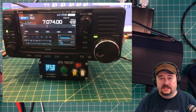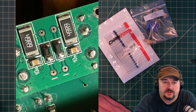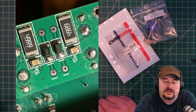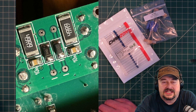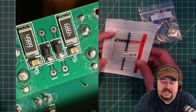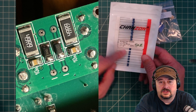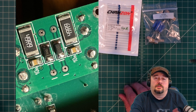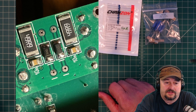This is the bottom of the board and some of the diode configuration. What you should be able to see on the screen now is the underside of the PCB inside the antenna tuner. This is underneath the SWR bridge or the coupler. The two diodes are in the middle, and one of them you can see is an SA-13. The other one, the markings are really faded on that, but it looks to be a different diode. I talked to my buddy Raphael, and he told me that what I needed to think about doing was replacing these diodes. I just happen to have a package here — 50 diodes that I ordered. I'd have to remove these two surface mount components and then use these through-hole ones. The board is actually fitted for through-hole soldering. I'm pretty shocked — I expected the inside of the board to look a lot better than this, and it's pretty bad.